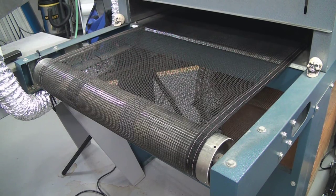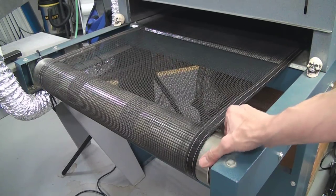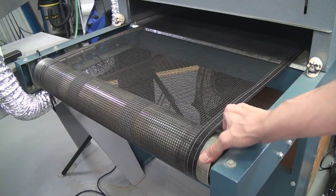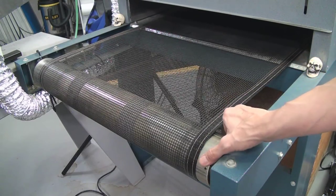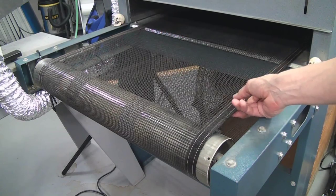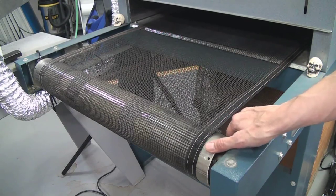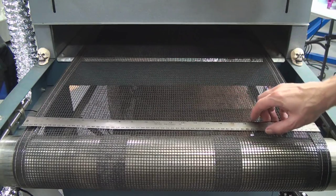The number one and single most important tip I can give you is: do not over-tighten the belt. You should be able to move the free-rolling pulley and the belt slides — there's slack in there. You should be able to spin your pulley and the belt should stay stuck on the motor side. That is one indication that you have enough slack.